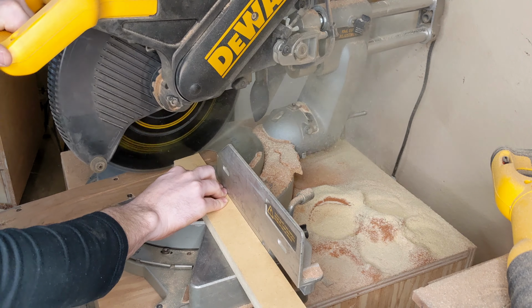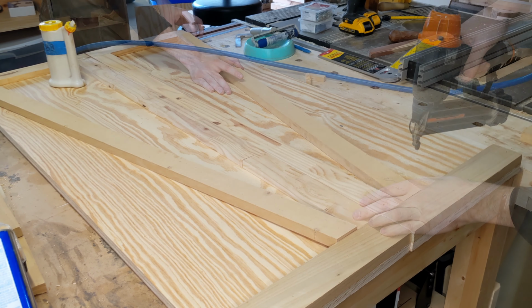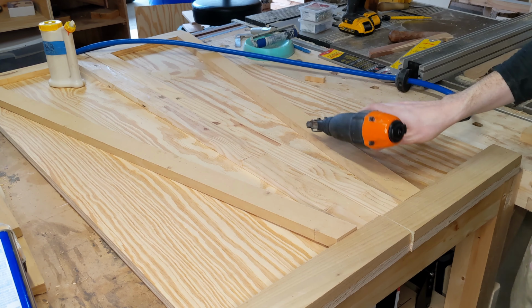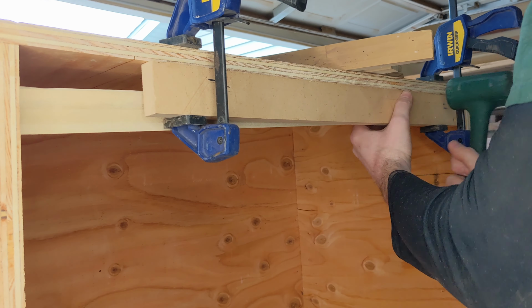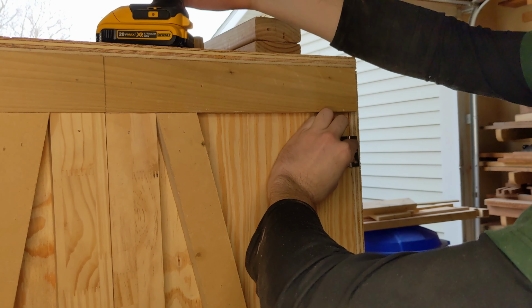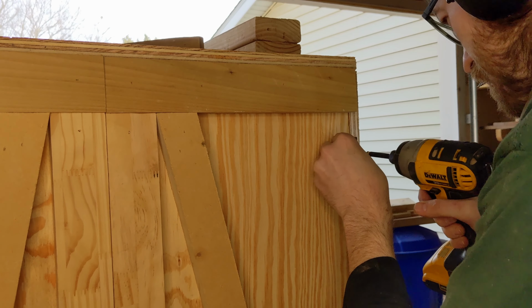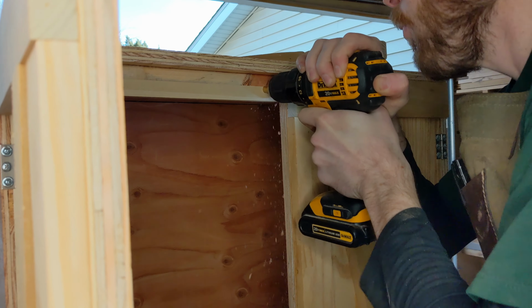And these braces are reused MDF. Hopefully there wasn't going to be any sag in the doors, but this should help prevent any. This is a stop for the doors on the side cabinet. Followed by the most basic hinge installation ever. I also had some decent 3/8 inch magnets, and I wanted to use these for a good hold on the doors.